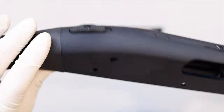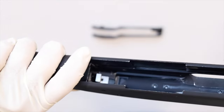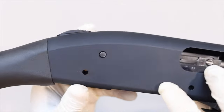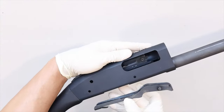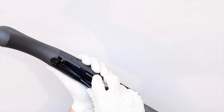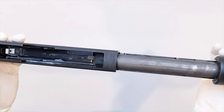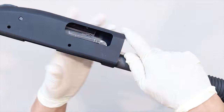Before you reinstall the elevator, make sure the safety is on. If the safety is off — in the fire position — it could get in the way of the elevator when you're trying to put it back in the receiver. The tabs on the end of the elevator bars fit into the holes on the receiver. Squeeze the bars together, match the tabs with the holes, and install the elevator. Now line up the rails and reinstall the forend. You'll see that the action gets stuck at a certain point — just push the right bar up, then push the left bar, and continue pushing the bars into the receiver.